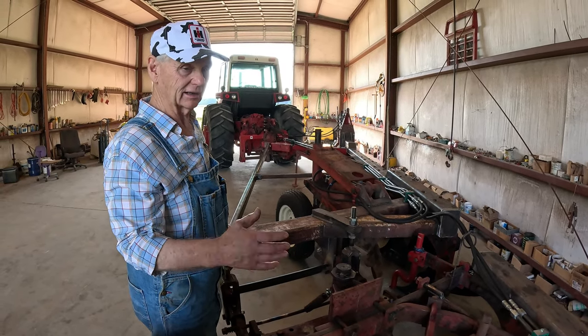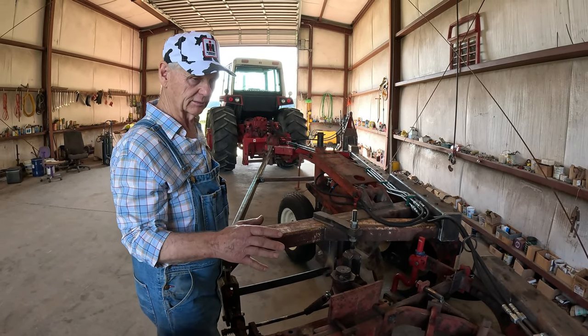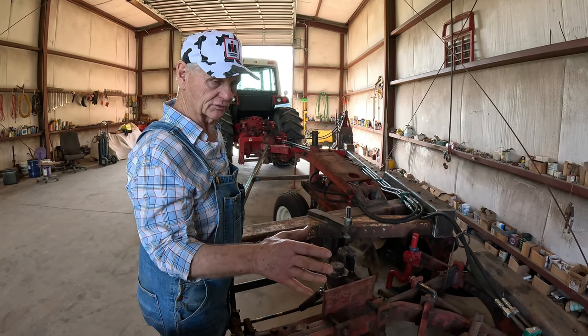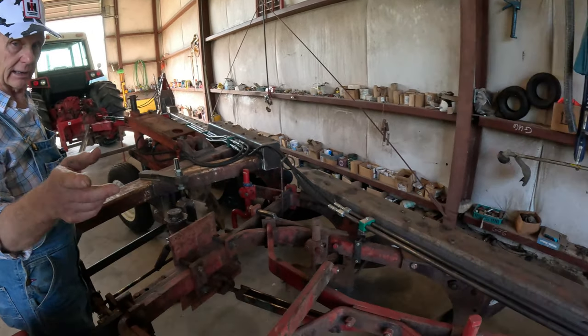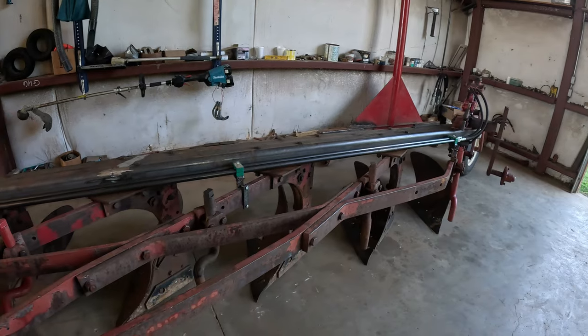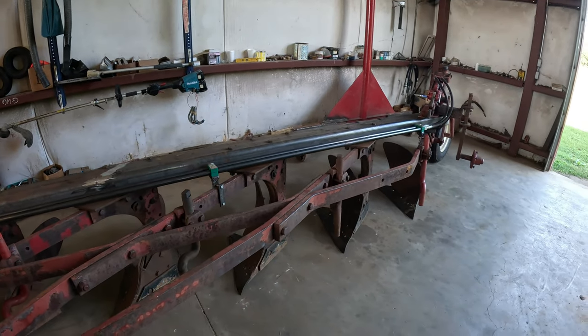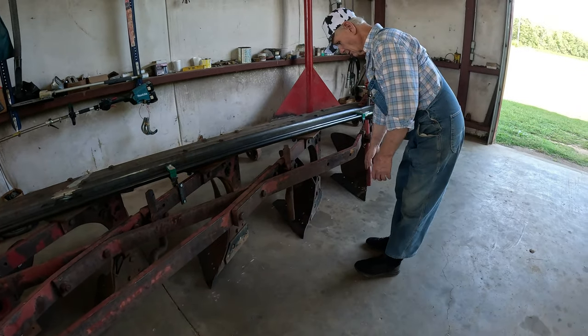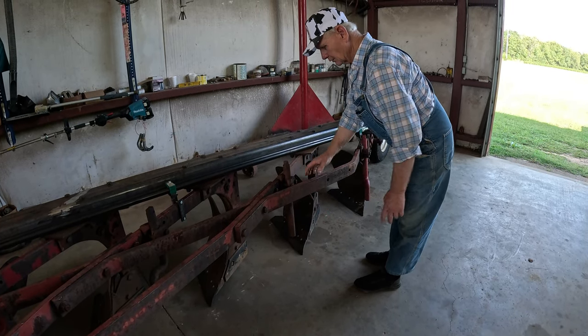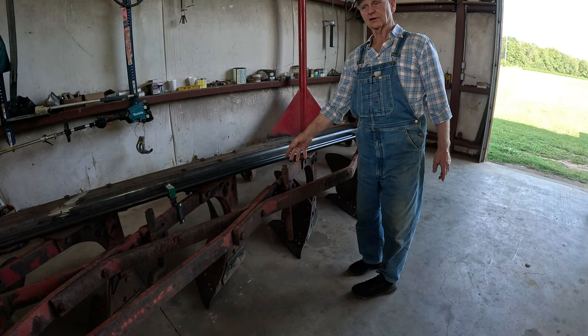And that's where, I hate coulters. They're a pain in the neck, but if you ever get them set, they really help you plowing. But you set your coulters. I'll start with the back, and I'll get that thing cutting 14 inches. And then when I come up to this one right here, I'd be in the ground. You got to go but a couple of feet. Go from here, hook onto the blade, and go over here and check where the blade's at on that one. And then you set this one and set them all the same depth.